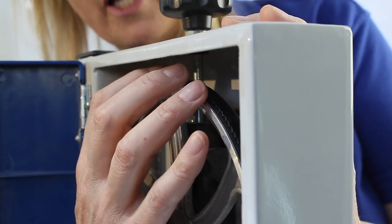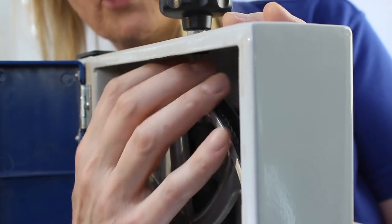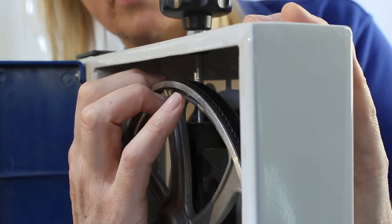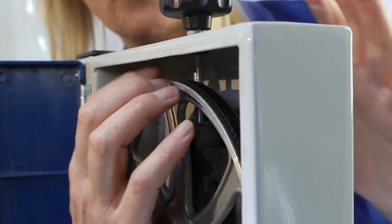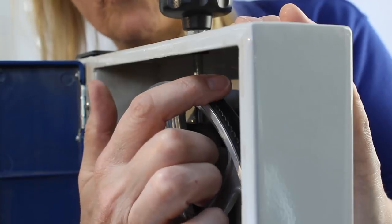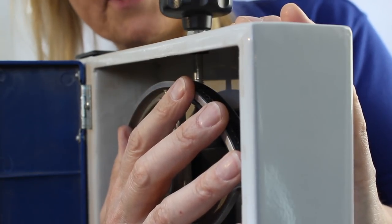If you deviate slightly to one side, the change in velocities and radii has a tendency to pull the train — or in this case the blade — back into the middle of the wheel. We haven't got that here, so I suspect if I removed the upper guide, the slightest pressure on the blade would immediately push it off the wheel irrecoverably. I hope that makes sense.